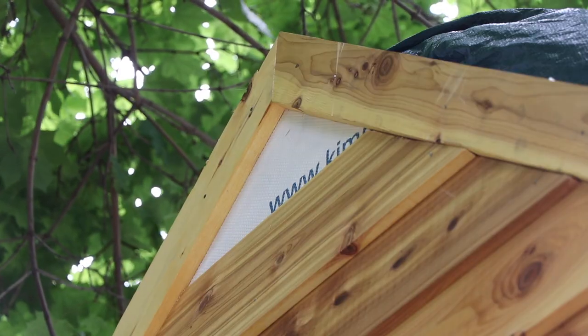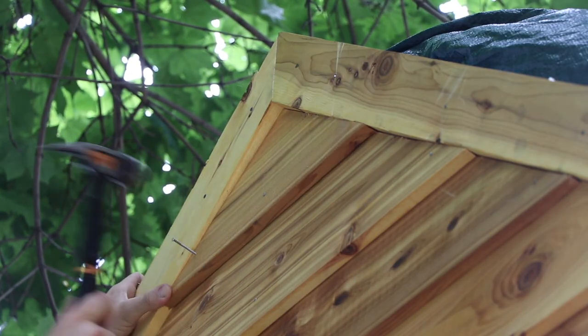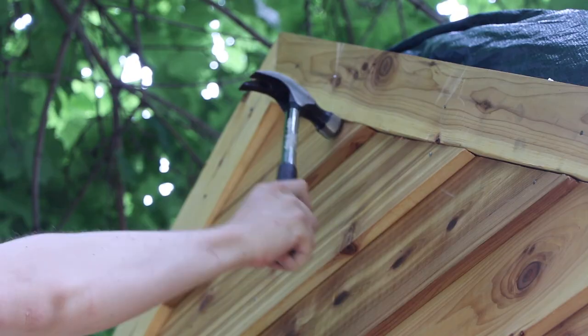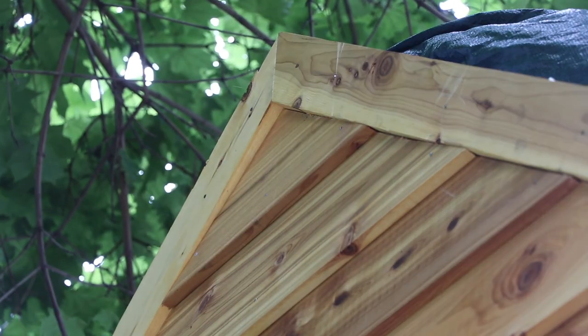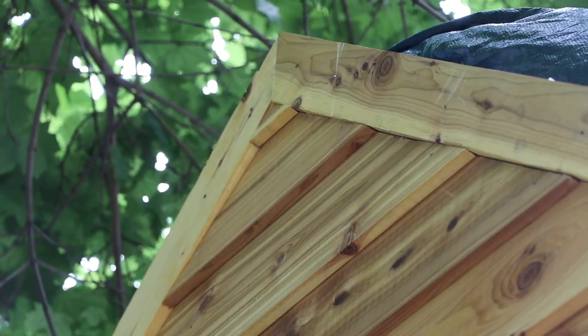This took a couple of days because with siding you have to avoid rain. I stored the cedar on a vapor barrier covered with a tarp to keep moisture off as much as possible — you don't want the boards expanding and contracting too much with heat and humidity, and you certainly can't install siding while it's vigorously raining. But once they're on, they're on, and it is so satisfying. I did so much research that there's not a single thing I would have done differently. Going forward, I plan to give it a good washing and a fresh coat of exterior oil finish every year to keep it protected for years and years to come.